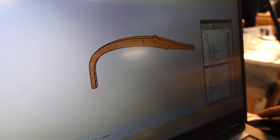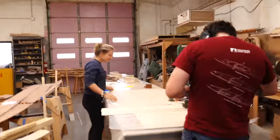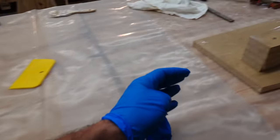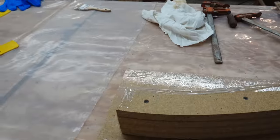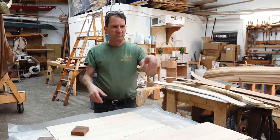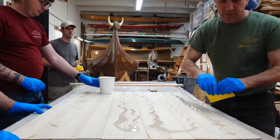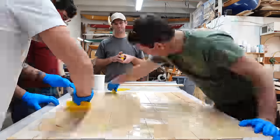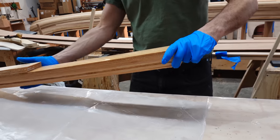They cut out these molds with particle board and then we're going to epoxy and laminate spruce around this mold here — 22 layers all together. Some shorter ones for the thicker part of the top; we don't need to run it all the way out to the end. You can try to brush or roll this epoxy — if you can do it faster, great. Without much trouble we'll do a second and third one too.